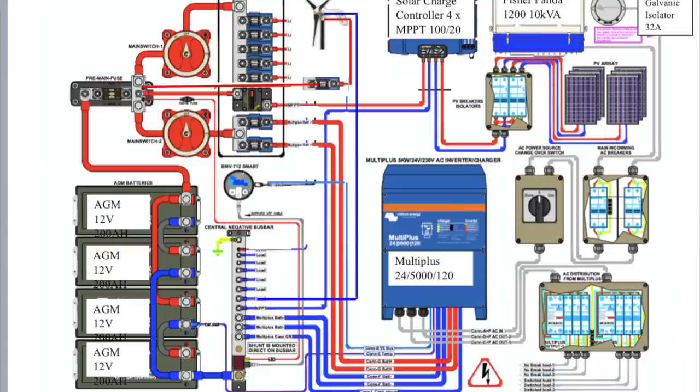Right. With the new wiring for the charge controllers and the batteries going from 48 volts down to 24, we're going to be making a couple of changes to our system. So Tim's designed us up a pretty badass electrical system. We're going to need a couple of kill switches. So we went into town and we found some of these Narva kill switches.